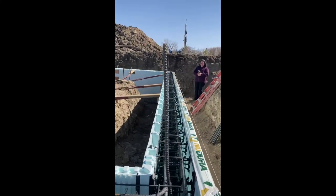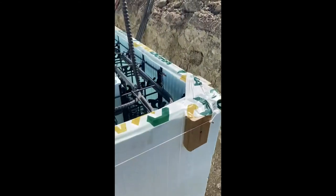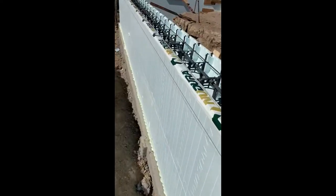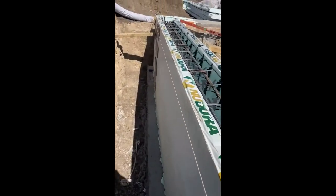Wherever you see this rebar poking up here, it's just an extra long piece tied to the pile, which goes underground there. And we're in this great place. This house is never going to move. Like, you can't ask for better ground to build in. Packs like concrete and doesn't hold moisture. Just keep working our way around here. The same, more frost wall.